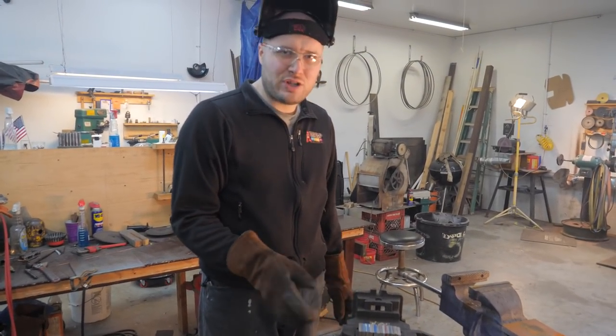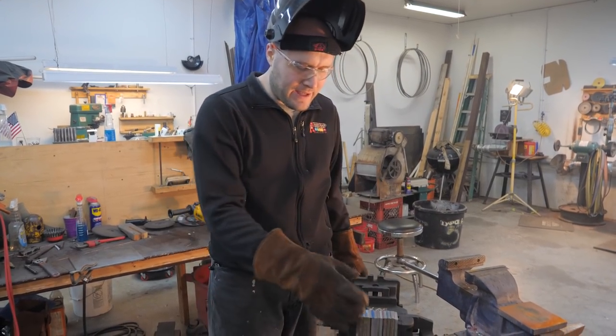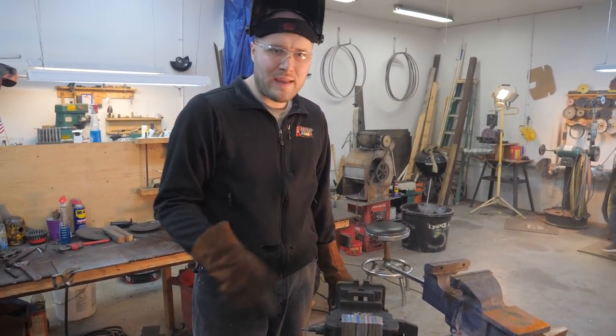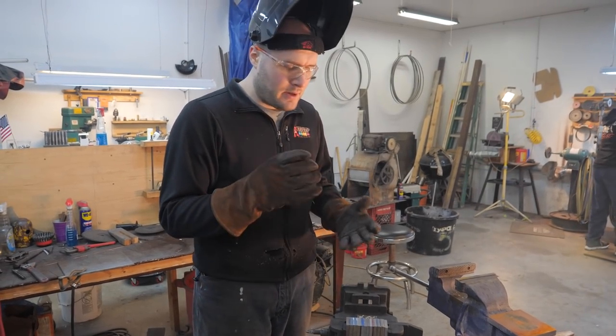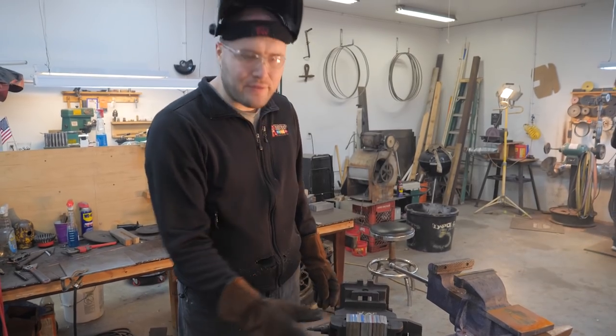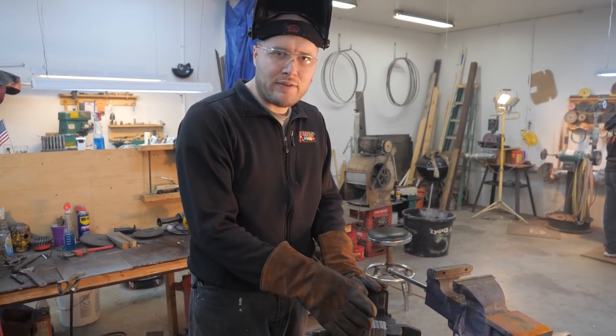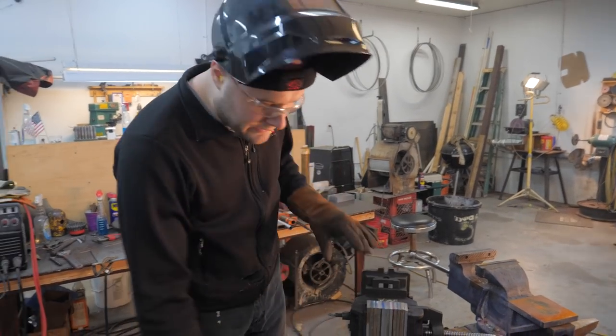So on the ends, I'm just gonna cover those with weld, and then like I said, we're gonna put sheet metal on the sides to keep the layers from getting any oxygen in there. I'm not gonna use any flux, and I don't have to cover it. Like, I could totally forge weld it without covering it, but this is just even more secure of a super clean weld when we're doing it like this.